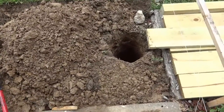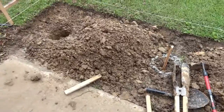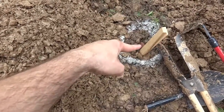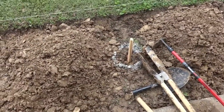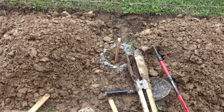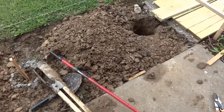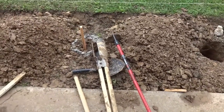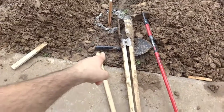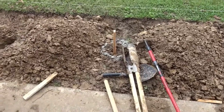I did a little research and found that our frost line around here is 24 inches, so I'm digging a little deeper than that. I decided to go to 36 inches down. I don't know if that's overkill or not but I'd rather be safe than sorry. To find the spots I drove stakes in, they were a little off center so I dropped a rock dead center and then I have these 8-inch cardboard tubes to fill with concrete to make the footings. I dropped it over my marks, spray painted around the bottom edge making a perfect circle, then dug just to the outside edge of that white ring leaving an inch to two inches to shift it around, then fill the outside with gravel and put concrete on the inside.